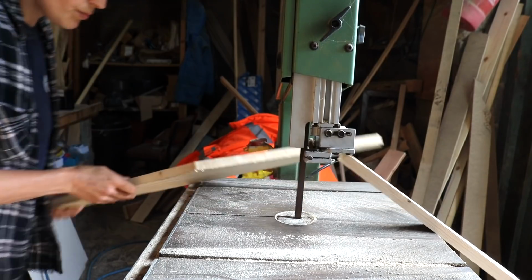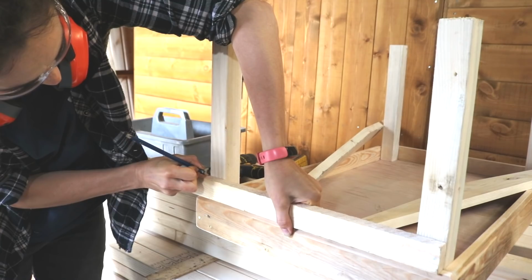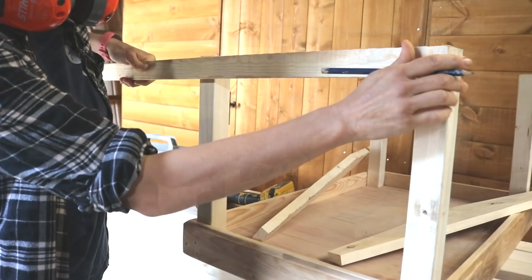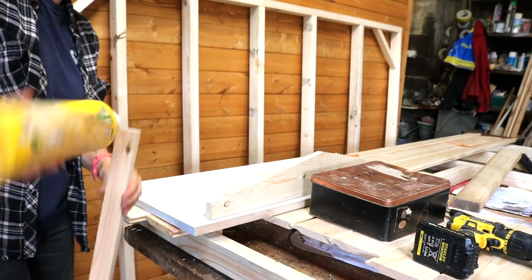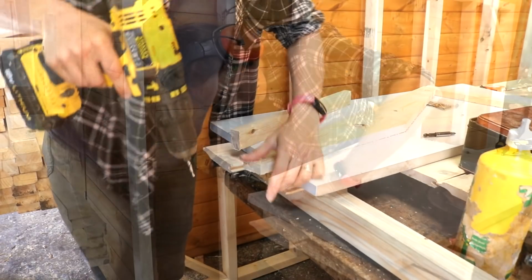Pretty sweet. Now to cut another 2 sides, I held another offcut along the 2 corner posts on the shortest side to match the width from the bottom, but don't take the measurements from towards the top as it's less likely to be correct. By the way, this offcut is also the same one that I used to mark the shortest height, so I knew it would match, and glued and screwed it together.